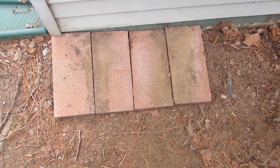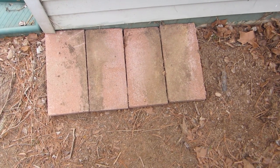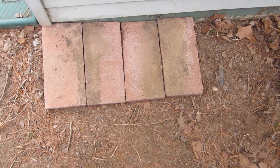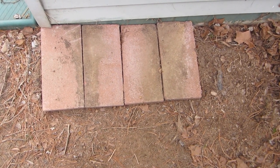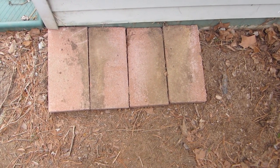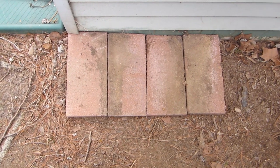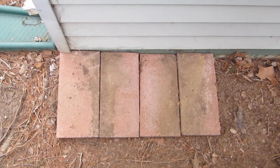I'm going to dig a hole a few inches deep around the area where these blocks are, and out some, because I'm going to need to put a few more blocks down and put some gravel in it to level it off. You have to make sure when you put a base for a rain barrel that it's level, because it gets very heavy — it can be a few hundred pounds when totally full, and you don't want that toppling over on anyone. So you want to make sure it's in a nice level area. The base is really a critical part of the setup.